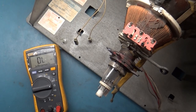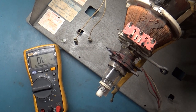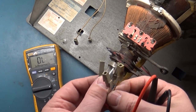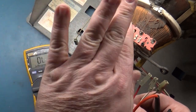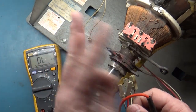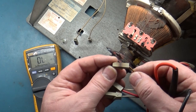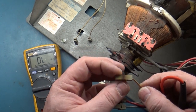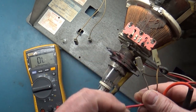The reason I decided to check the yoke was because somebody has broken the connectors all around. This is due to — if you put it in the game and the image is upside down or backwards, you can switch the yoke connectors around and flip the image. So someone's done a bunch of work to this. And also if you look here, we've got a burned up connector — and this is one of the connections for the vertical. The horizontal is the red and white, and the vertical is gray and brown.